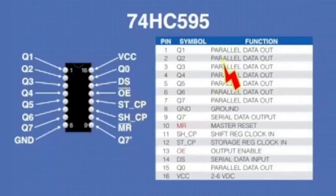Starting with Q1 — that's parallel data output, one of your LED outputs. Q0 is pin 15. Then Q1, Q2, Q3, Q4, Q5, Q6, and Q7 — all your outputs for LEDs or whatever can safely connect to these shift registers. Be cautious — look up what you can and can't do. I haven't been on my Pi for about a month and a half because sitting forward is hard with my sore back, but I'm really trying to get this video done.